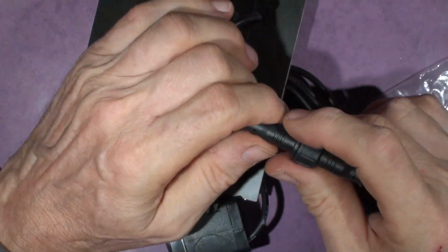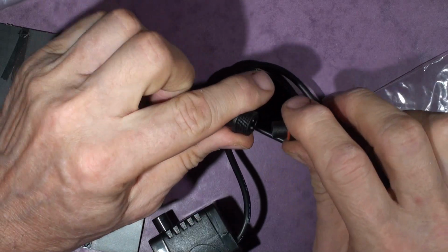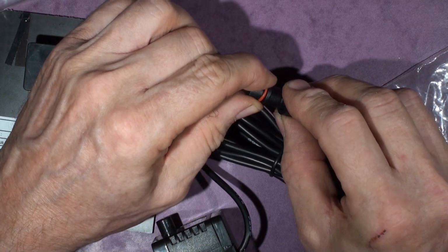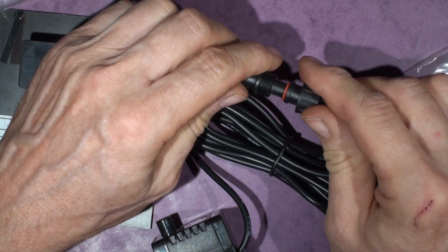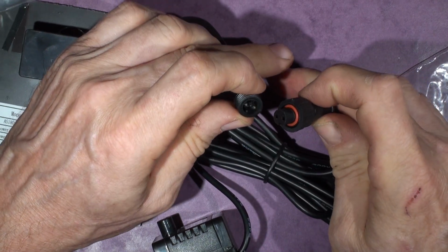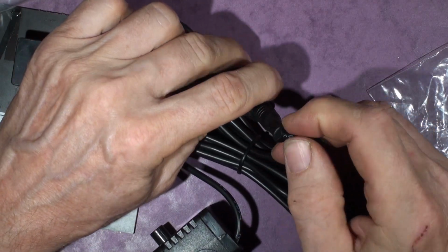on there, and then they've got this connector here to connect the solar panel. Oh, that's nice. Yeah, a lot of them haven't got this. A lot of them just got an ordinary DC jack. Look, it's got a waterproof plug. It's a 2-pin jobby there, and it's keyed there to make sure you don't put it in the wrong way around. And then you've got this nitrile rubber O-ring here. You can plug the thing in. It's actually quite good if you want to feed the cable through a bulkhead or something as well. I'm guessing would be. I'm not sure actually. Yeah, so it goes back together and in there like that, and as I tighten that up it clamps, so that's good. A waterproof connector, and these are over moulded on, so they'll be waterproof.